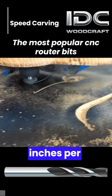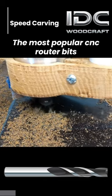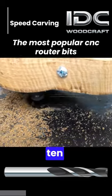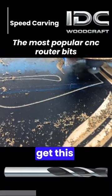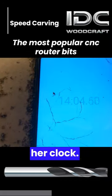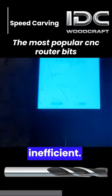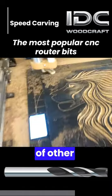All this is at 200 inches per minute — look how fast it just carved out this 10-inch area of the lion to get this outline. We'll take a look at the clock: that was 14 minutes, and that was still inefficient. I could have got it down to 10 minutes with just a couple other settings.